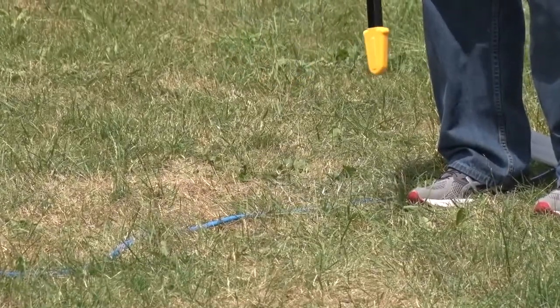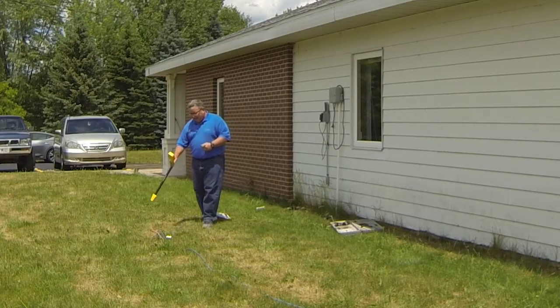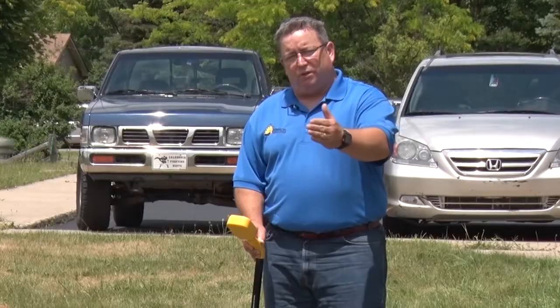So with zero, it goes up to 44, then zero, then 44. As I go down the path, I'm going to be marking it. You have to mark the path of a two-wire system no matter what you're troubleshooting. If you don't know where the path is, it's going to be difficult to tell how far down the path something might be. So we want to make sure we mark it as we go through this process.